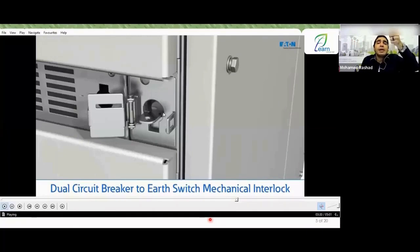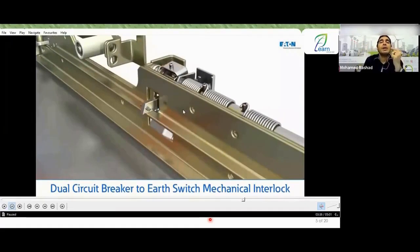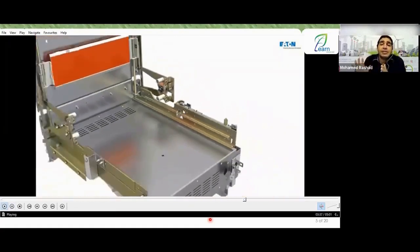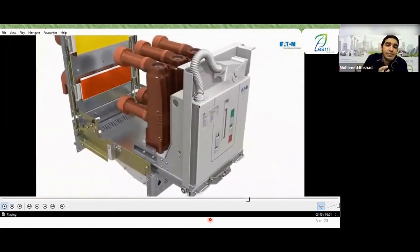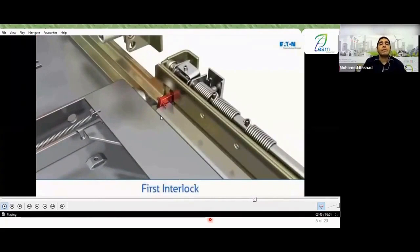As soon as you lower this shutter down, it means that now you have the place where you will insert the handle of the isolator to close it, right or wrong. Look with me now at what will happen inside. Here, a tongue comes out, see? So what will happen with this tongue? If you try to insert the breakers, look here, see? You will hit here. So you can't rack it in. As long as the breaker rack didn't open these interlocks, which are in the switchgear state, the spring wouldn't bring the knob to the B position, right?